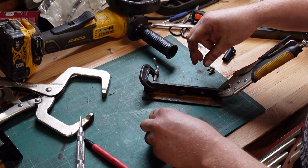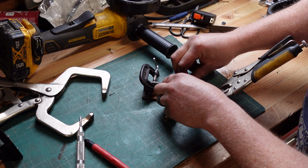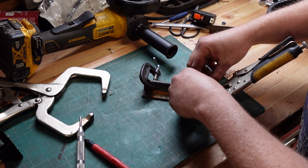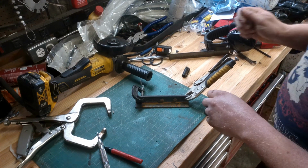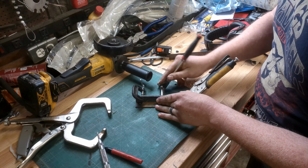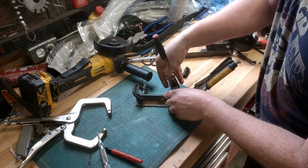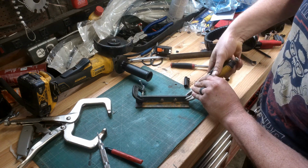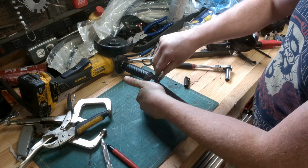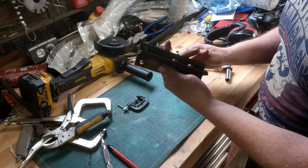Now we can take some 1/4-inch bolts, some tiny ones, and bolt those two halves together. And then we can make our cuts. Alright, ran out of battery with the good camera, but basically we can now bolt these together. And now we can cut with the cutoff disc and then bring them over to the bench grinder, and we don't have to keep them clamped together, and we'll know that they are nice and symmetrical. Even this surface is nice and perfectly flush because we took our time.